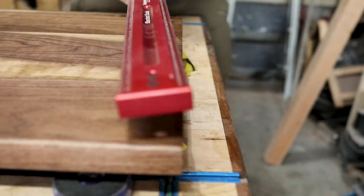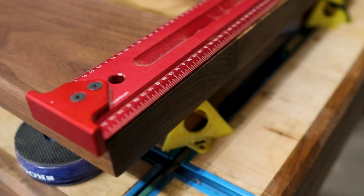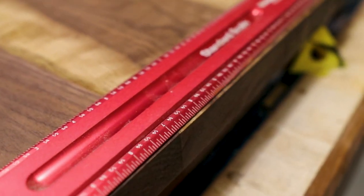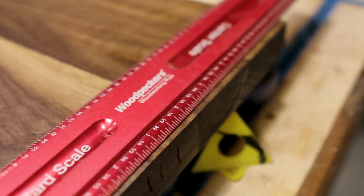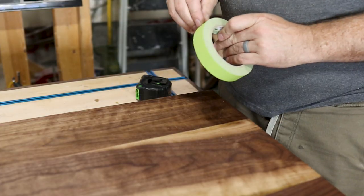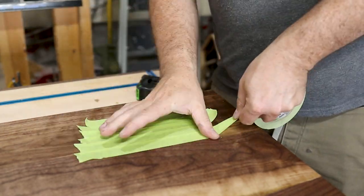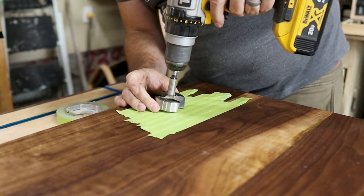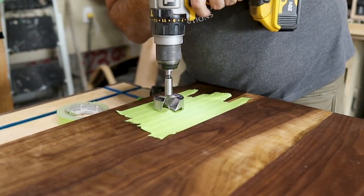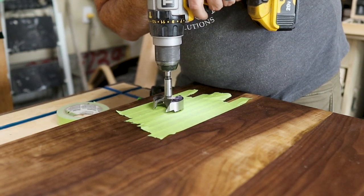This really demonstrates why I use the template — you can see how far out it is from front to back, and you're always better off making your piece fit to the space rather than just cutting a perfectly square piece. Now, no project in my shop is complete without at least a couple of mistakes, and in this case I totally forgot that I needed to add ports to the back so they'd be able to sneak power cords up through the cabinet to the countertop.